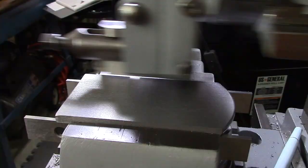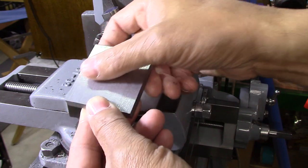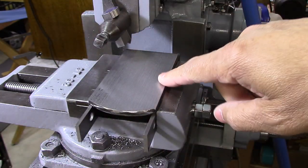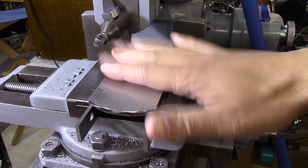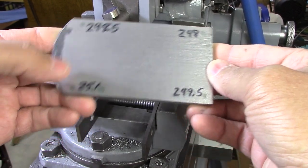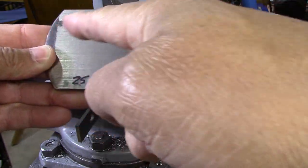I used a test piece with different cutters, different angles, and different depths and got something I really liked — a nice smooth texture and finish. Then I went on the same material and got an almost mirror-like finish, kind of like brushed stainless. You can see my reflection in it. Now I'm going to measure it up and we're going to make this into vice jaws. Measurements: 248 and a half, 251, 248, 249 and a half — not horrible.